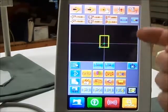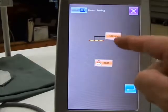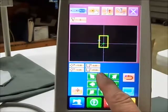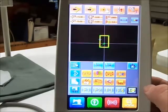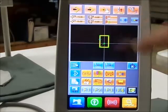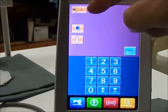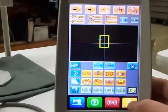Now a simple tie-over stitch — again, linear sewing. Enter that. Leave my parameters the same, enter that. And I'm going to go half the distance just because we can, to fifteen. Point set, enter that. Now my pattern is completed. I want to add the trim — yes. Now you see the icon jump there to show trimming. Now I can enter this, and it picks the next available pattern which is three. I just simply say yes, and with that the sample pattern is completed.